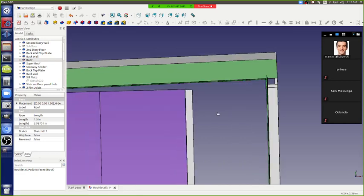Yeah, psychologically, it's just scary to look at a little bit. But it makes sense what you're saying. Psychologically, it looks scary. I agree with you. In this drawing, in this side view, you have to consider also that it is a side view and it's missing the sheathing. The sheathing is what stabilizes for racking. So compressive-wise, you can say racking.